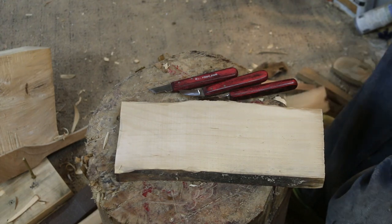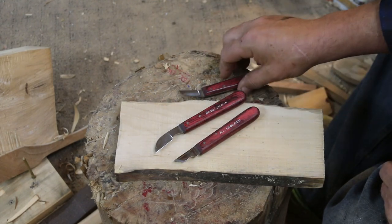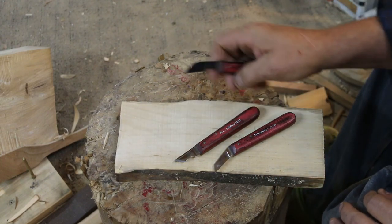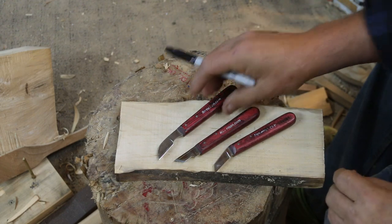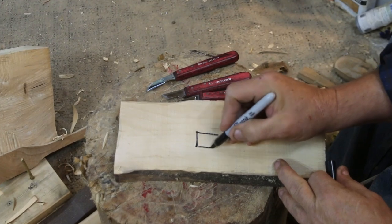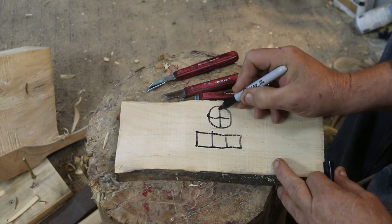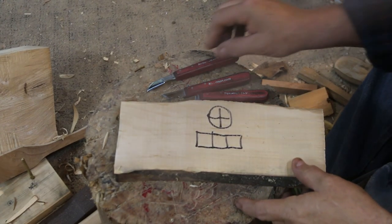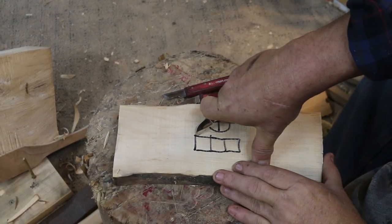Here are the three basic chip carving knife shapes — this is a set from Ramelson, down in the description. One has a hook; the blades are all facing towards you, designed for slicing. There's a different technique for holding these — they're stabbing and slicing knives. I've laid out a pattern — about 12 times bigger than it needs to be for real chip carving. It's got round shapes and square shapes in a repeating pattern, typically Swedish or Norwegian in origin, used to adorn various items. This is a stabbing knife — I've got it down in there at a slight angle.